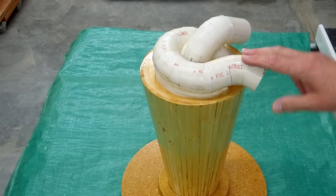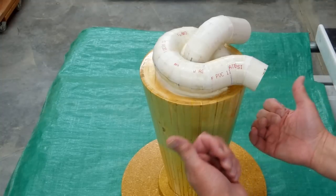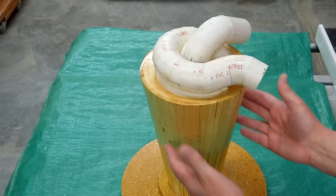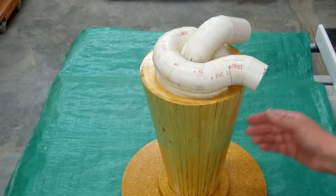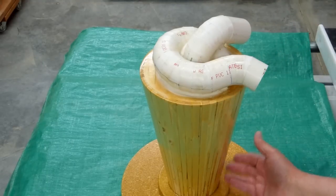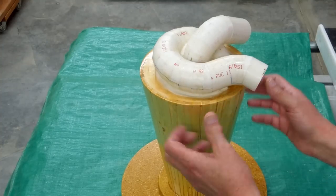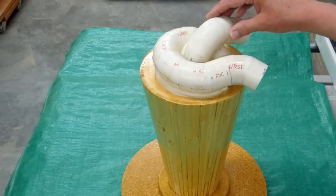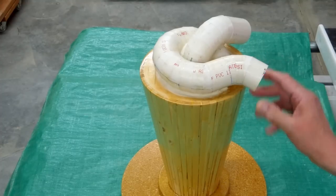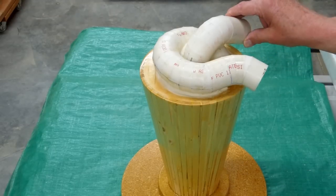The air velocity on this is very high. The speed of rotation is very high and centrifugal force slings the particulate matter and sawdust to the outside, up against the walls of the cyclone. This taper is there to help maintain the speed of rotation as gravity pulls the heavier particles towards the bucket. As the particles separate from the air, the clean air returns through the center pipe to the shop vac. And all the sawdust and particulate that we pick up with the shop vac hose ends up in our 5-gallon bucket. The clean air returns to the shop vac.